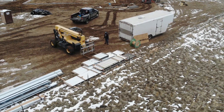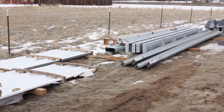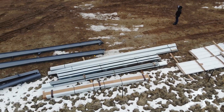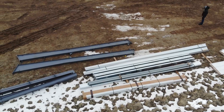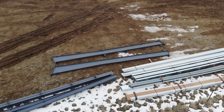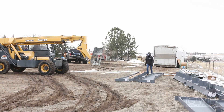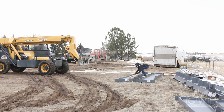If you're not erecting right away, you should place your bundles at an angle to keep water and snow from pooling or sitting on them. If you tarp the building, keep an air gap between the steel and the ground for ventilation to keep your building dry. When you stage your job site for erection, you need to access the structural beams, girts, and purlins first. Keep these items as close to the foundation as possible, but make sure you leave enough room for the crew and machines to move around.